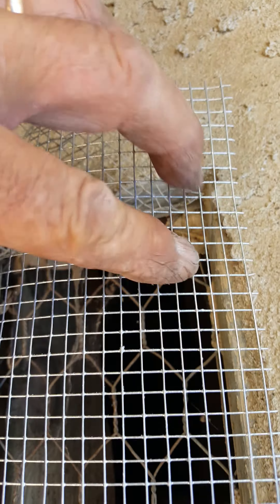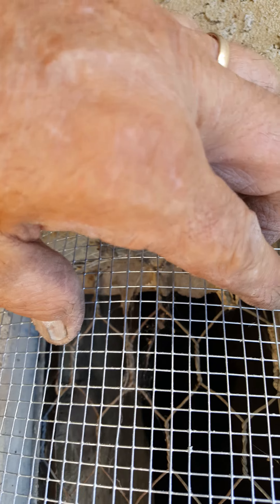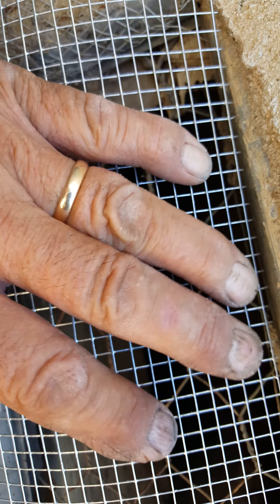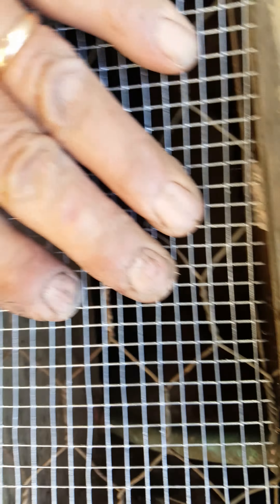Grab the whole screen and shove it with hands on both sides of it. Push it so it slides back into the slot. I have all this locked in. Then go ahead and fit the bottom in, fit the top in as you come across. It's gonna get a little kinky up here so you want to just keep working it. Use needle nose pliers to grab hold of it when it's in the wrong spot and pull it away so you can get it up in the channel. Once you get it all in the channel you can push it down and smooth it — it'll fit up inside that groove.